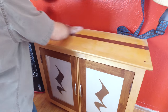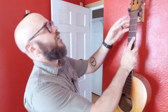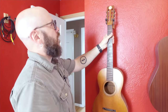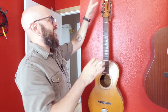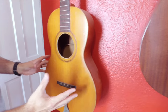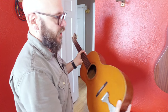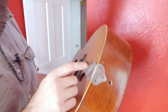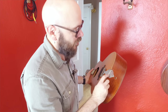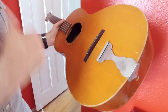Look how dusty that is. But there's a walnut stripe that goes all the way down, and it's got some contrasting plugs — it's an 1800s Empire State guitar. Somebody told me one of the guys from Martin went off to start his own company, or one of the guys from this company went to work for Martin. This belongs to my stepdad and it's coming apart, so I need to re-glue some things. Since it's from the 1800s it probably has hide glue, which I can just heat, pull apart, and then re-glue. One of the issues is the bridge down here — it's cracked. I'm looking for ideas on how to repair this crack, because if I put strings on here right now, it would just break right off.